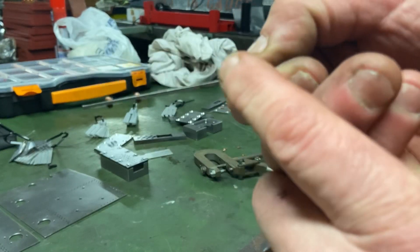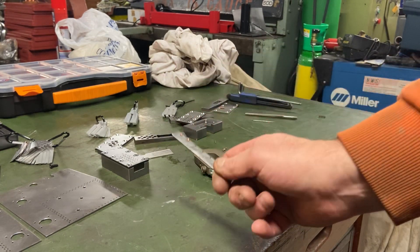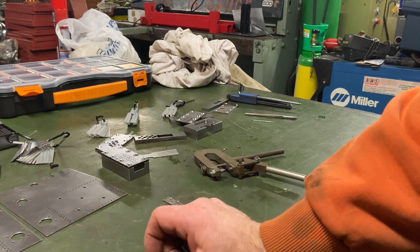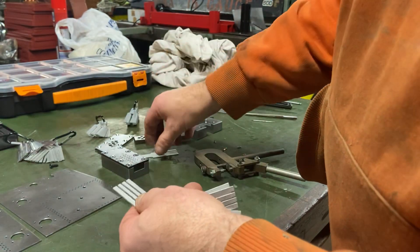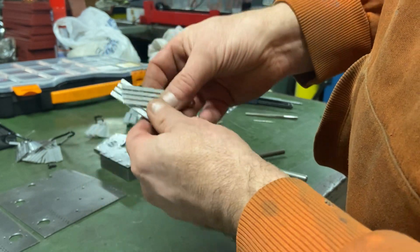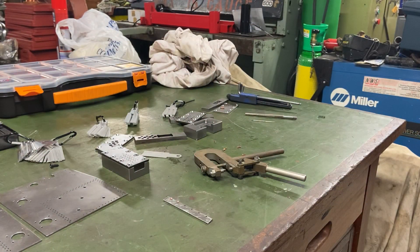Well I hope you found that interesting. As I say, Aron Tools originally made a tool similar to this but you could only do one rivet at a time, and they didn't supply shims — you had to make up like washers to go under each one. The advantage of these shims is I can actually stack them together, so if I wanted say 2mm I can step the shims together to give me a combination of different sizes underneath the head of the tool. Thank you very much for watching — if you'd like to, please subscribe to my channel.